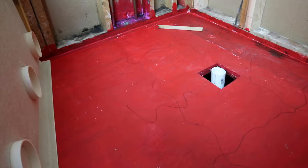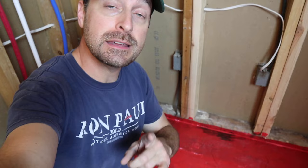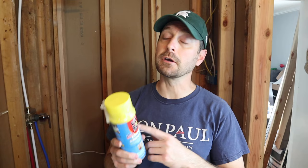I marked on the floor where we're going to put our mortar. That mortar is going to sit between the little feet on our shower pan. I also have the shim in place for the only spot on the pan where it's not level. I've got a red floor — that's red guard. This is an unnecessary step for most people, but I want an extra layer of defense on this floor just in case this shower pan cracks and starts to leak. Now it's time to mix up our mortar, which is what this shower pan company recommends. But there is another way — non-expandable window and door foam — and that method was very successful, but today we are going to use mortar.